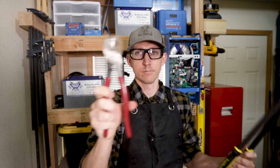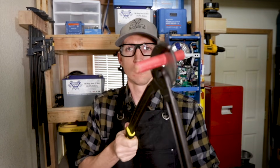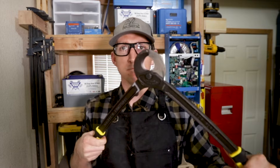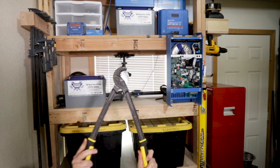The last tool on my list is this big monstrosity — these are 16 inch cable cutters. These are key for cutting the 4-0 wire required for camper electrical systems including 3,000 watt inverters. They cut through 4-0 like butter, and I'll generally also use these for 2-0 because of just how much leverage I can get on them. These are pretty pricey at nearly $60, but when building a 600 amp hour system with a 3,000 watt inverter it takes about 30 cuts to complete the project, so it is what it is.